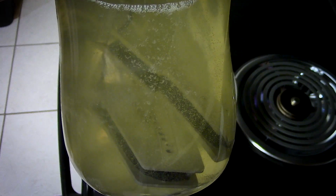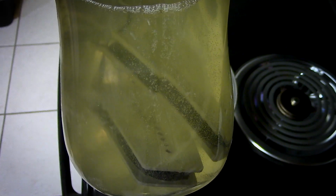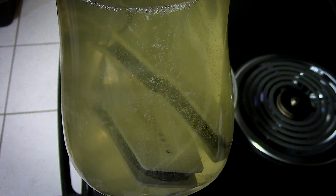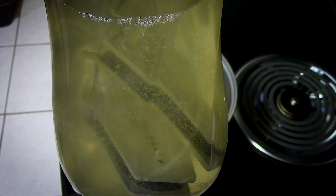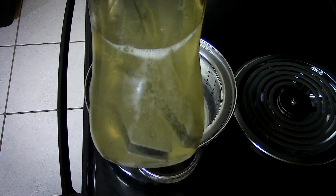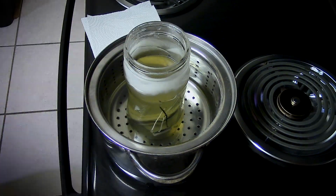I'm aware that some people who wind pickups say not to vacuum pot pickups, saying it kills the sound, that they prefer to just soak pickups in hot wax and that does a good enough job, and that may be true. I think that would be a test for another day to compare a vacuum potted pickup and a soaked pickup and then cut them in half to see how well the wax penetrated. But I'm not doing that here. I'm just vacuum wax potting all of the pickups.